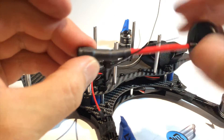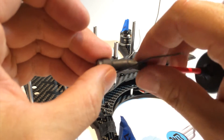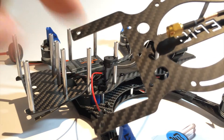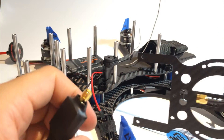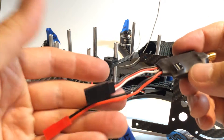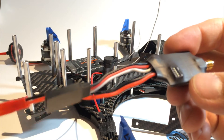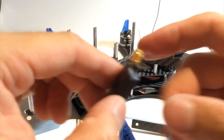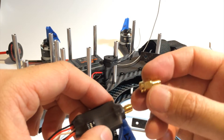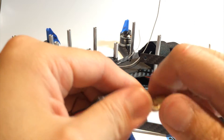On a side note, I like to apply heat shrink over the antenna to cover the SMA — that way you can use the entire shaft to tighten and untighten the antenna. Next we need to add the VTX. This is the VTX available on the store from Surveil Zone — it's a 600 milliwatt version. It uses an RP-SMA antenna so we need a gender bender to convert it to SMA.